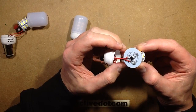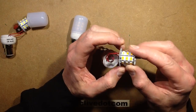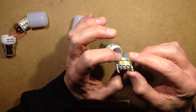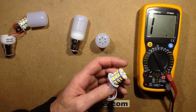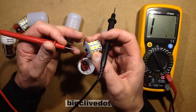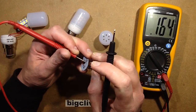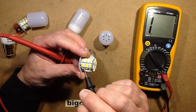There's a bridge rectifier on the bottom. A couple of solder joints - could they be a resistor? The LEDs and tracks on here are not zigzagging all the way down. I wonder if each of these circuit boards has a resistor in the back. Let's check for continuity between the output of the rectifier and the ends of the LEDs. It's going straight to the ends of the LEDs. So I'm guessing these do have a resistor in them, perhaps in the back.